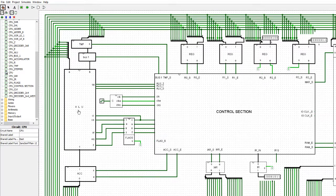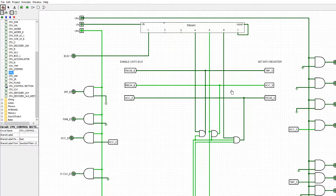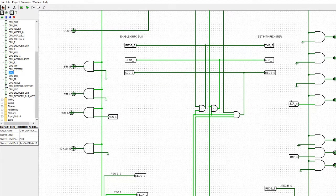So we'll just get into the accumulator, make it a bit bigger. So we've got 4 there, we've got 3 there, so it's adding them together, and it's coming out with the answer 7. Now the answer 7 is just sitting here, so nothing will happen until we pop it into the accumulator. Now nothing's going to happen with that value until the accumulator is set on the bus. So that'll go in the next clock pulse.